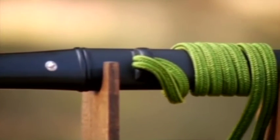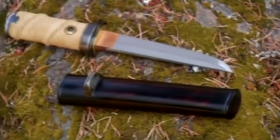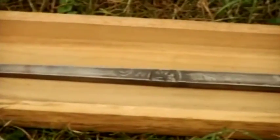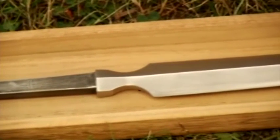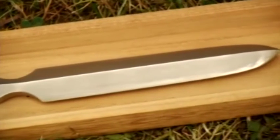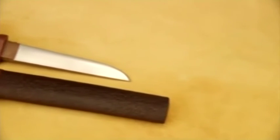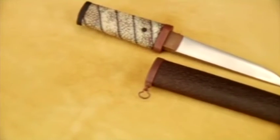When I'm finishing a knife, I'll do the rough polish just to the point where the blade has its final geometry, then I'll do all the woodwork building the other metal fittings. The very last thing I do, once the knife has been completely built, is the final polish — and the final polishing takes almost as long as all the other polishing together. It's just working with finger stones to bring out the temper line, the hamon, and show the grain of the steel. That's when the whole project comes together and you finally get to see what was in the steel hiding all along.